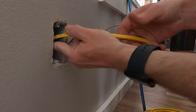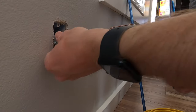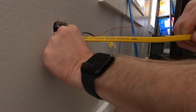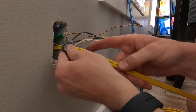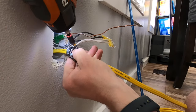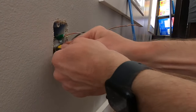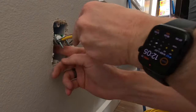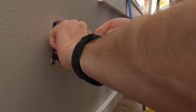On the outside box, the plastic tab held the wire pretty secure. On the inside, I used a Romex clamp meant for circuit breaker panels, which prevents it from being pulled outside the box. Some may say per code you need to secure Romex to the framing within a certain distance of the box. With such a short run, I would say that's secured — but it may come down to which inspector you get and their interpretation of the local code.